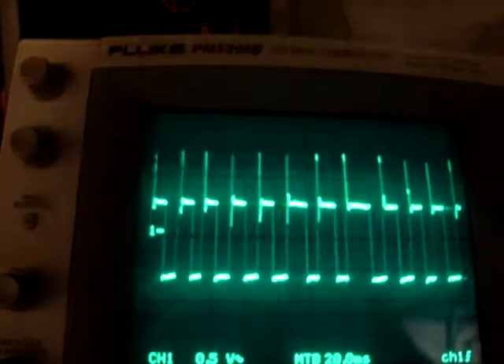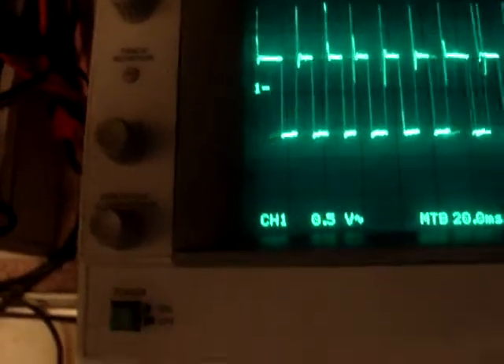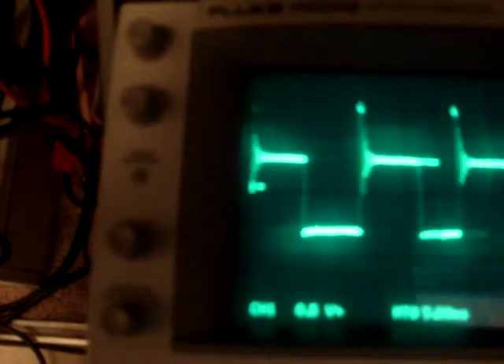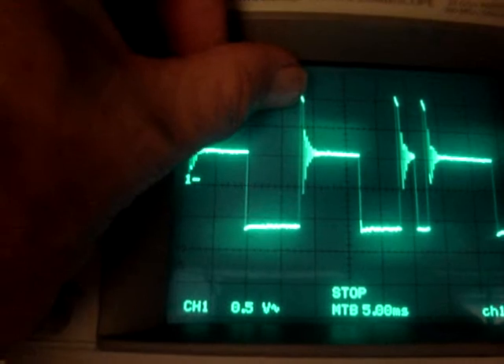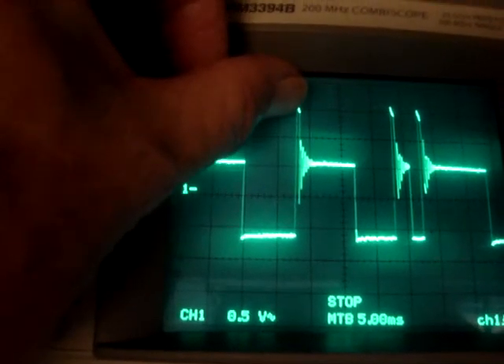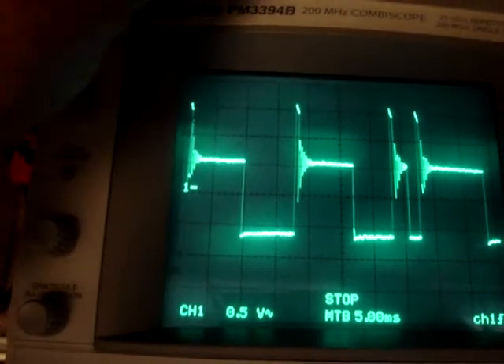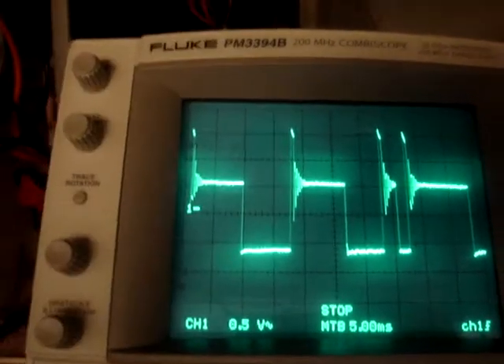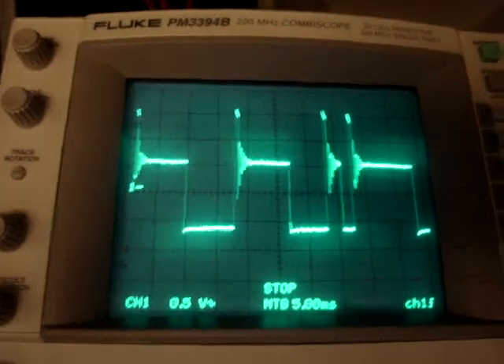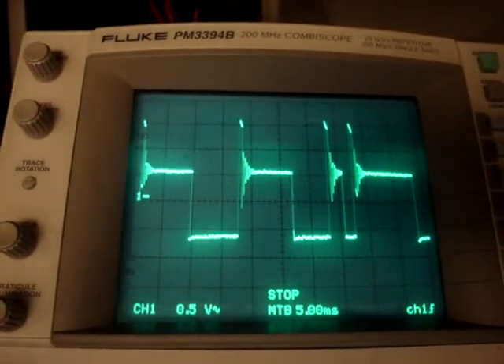It was for you. An interesting thing is, Stefan — and you'll appreciate this — when you see the tops of the waveform, let me stop it here: you can see that the clipping action right up here occurs at the base voltage of the cap. As the voltage builds up in the cap, it will go up until it hits that voltage, and right there at that little spike is where the diode conducts. Where all this energy is coming from beats the hell out of me right now, but we're already up to 10 volts.